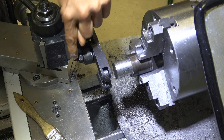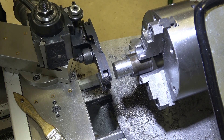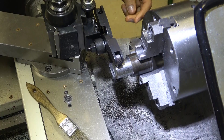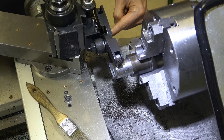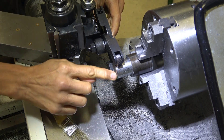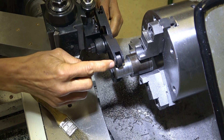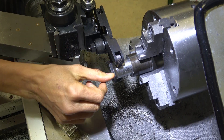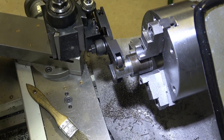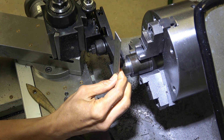The bolt here is the pivoting point for the knurl, and I believe the center of the bolt should be at the center height of the lathe, so I'm going to go ahead and try to adjust that. Tightening the knurl tension nut should bring the knurls together over the part. The final adjustment should be centering the axis of the knurls over the axis of the lathe. There's a tiny nubbin here and I'm going to use that as a reference with a straight edge to get it about right.